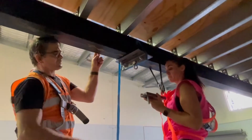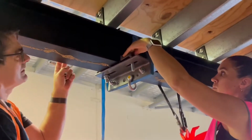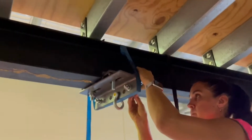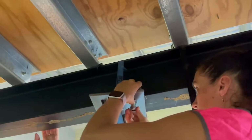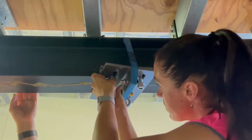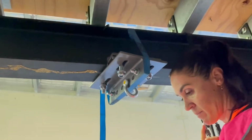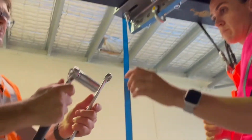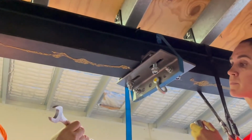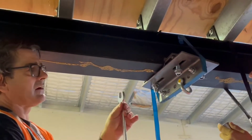It's now time to put the second top flange on for our beam clamp. It'll go through, I'll keep it under the safety. The 2 bolts will go through the slot holes already prepared, and you can set the 2 screws in place. Now we're going to use tools that you've already prepared, with the large enough socket wrench and the top wrench, and we're going to start to tighten these bolts until we can nip it tight enough and start aligning our beam clamp with our marks.